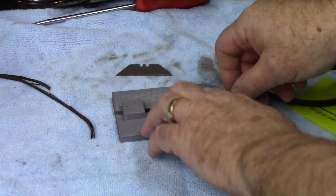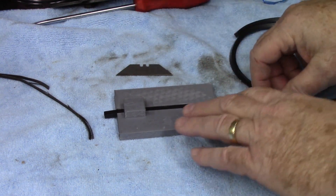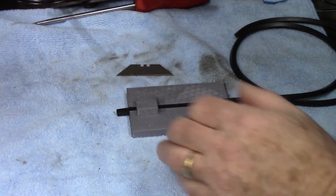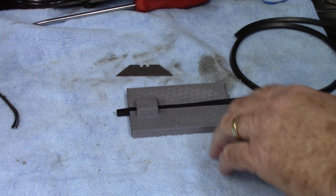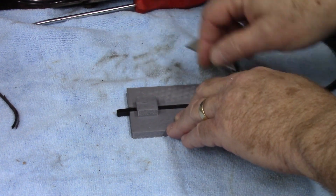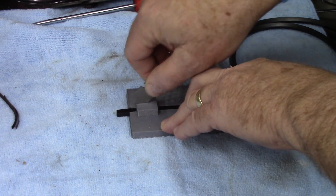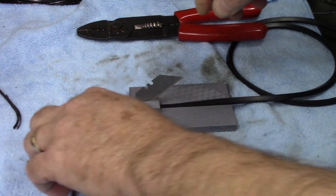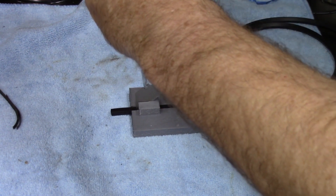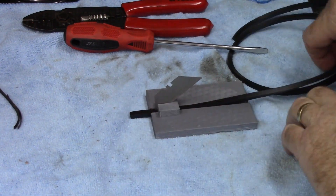My cutter is made to handle the 3/16ths inch square material. My plan is to pull it through here and split it to the thickness I want, which is going to be thicker than the original. This is a corded belt, and my replacement is not a corded belt, so I want it to be thicker. It's made for a razor blade to go down inside and smash through the rubber and into a slot made down there.